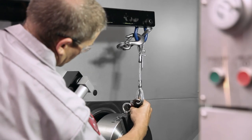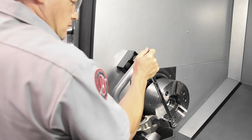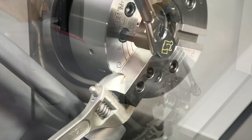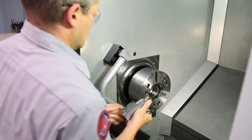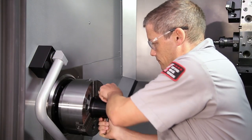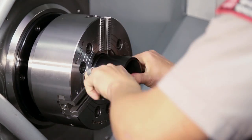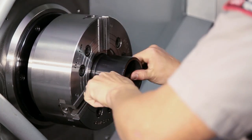Andrew detaches the hook and moves the hoist out of the way. He installs one of the top jaws to counter spindle rotation, sets his torque wrench, and torques the screws to the value recommended in the manual. Andrew removes the single top jaw assembly, then continues threading the draw nut clockwise inwards until it bottoms against the end of the draw tube thread. He then rotates the draw nut two and a half turns in the counterclockwise direction, which will position the master jaws close to the correct point in their travel range.